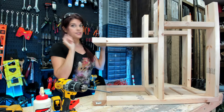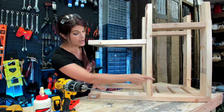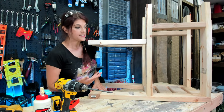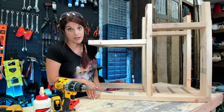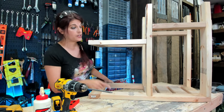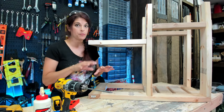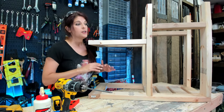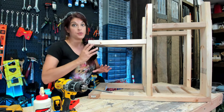But now, decision time. Here is the base. We're going to put two casters on that end right there. And then the wood is going to come down, and the casters are 3-inch wheels. So for argument's sake, let's say it's a height of 4 inches. So this piece will come from the top and then go 4 inches past the bottom here to account for the casters. And so we'll just be able to lift this thing and wheel it around. At first I wanted to put all four casters all the way around. The reason I went against that is that if you have a brick or a stone patio, the cart could rock. It might not be even. You could try and shim it, but you're shimming wheels, even if they're locked. So perhaps a better thing is to have those wood stands going in, because you can shim those and you can get a much steadier cart.